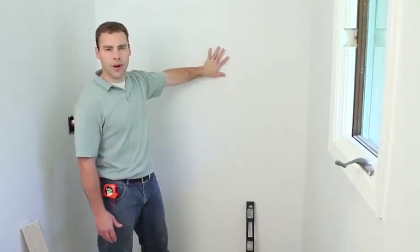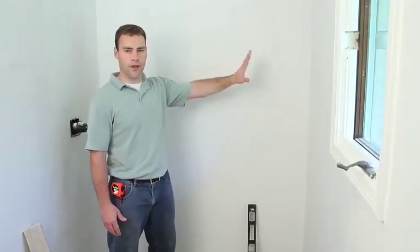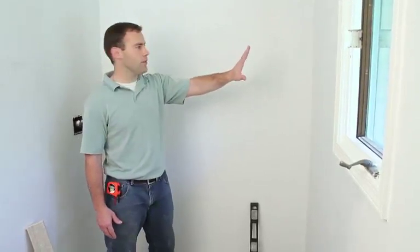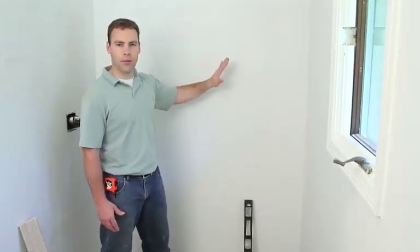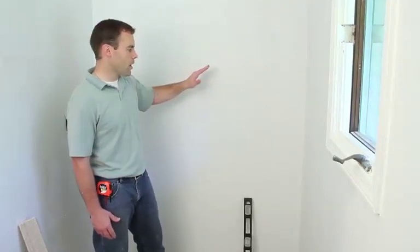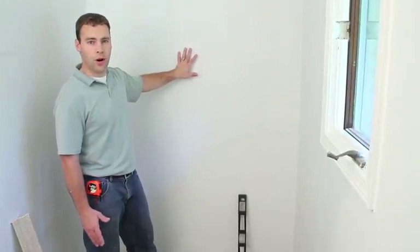Wallboard can either be sheetrock, hardy backer board, concrete board, pretty much any wallboard system is fine to use. I do recommend throwing a coat of primer paint on the wallboard. The primer paint simply seals up any dusty nature of the wallboard and also gives the silicone a good surface to adhere to. So once the wallboard is up, the next step is to install the wall panels,